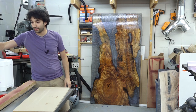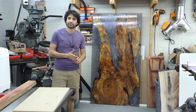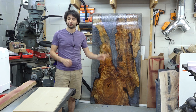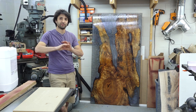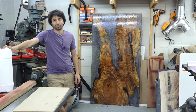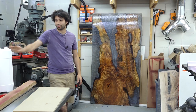The one I'm using is Eco-Poxy's Liquid Plastic. I've used that in the past and have decent experience with it. Other manufacturers make this now too — Polymers has their Chill, I saw System 3's deep pour epoxy demoed at Weekend with Wood, and Mass Epoxy sells one as well. They all have a slow cure, which gives a lot more time for heat to dissipate naturally without overheating the pour. This stuff takes 72 hours to cure on the label, but all the winter ones I've done have been more like four days. That gives plenty of time for the heat to dissipate, and also for bubbles to naturally come out of the resin and pop themselves.